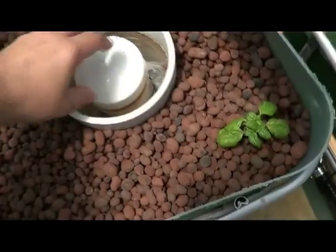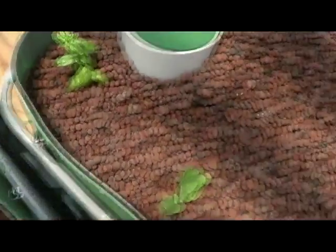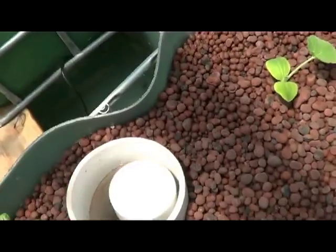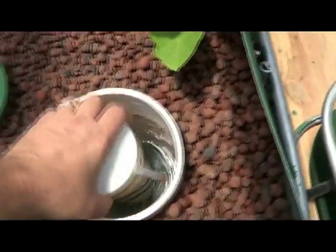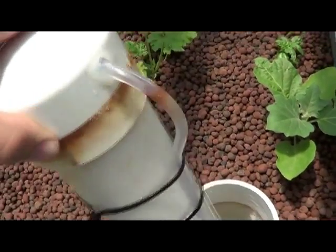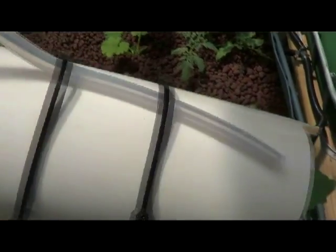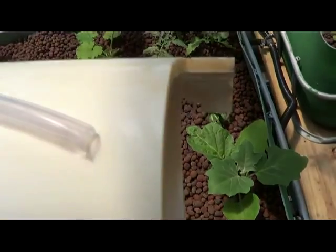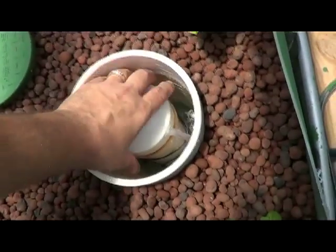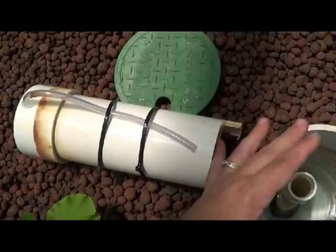While I'm at it, on this one here I added the air brake, as you can see. This other one doesn't have it — it's just the bell. This one wasn't breaking cleanly as I liked, so what I did is — you see at the bottom there — it's just a tube going in, sealed right there, positioned about an inch above the brake. When the water is draining down it was sucking air in.